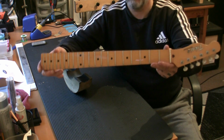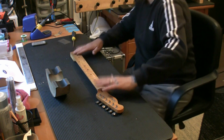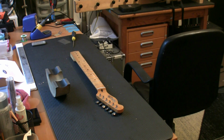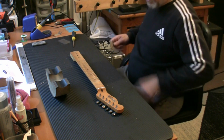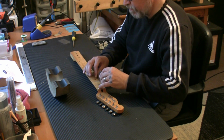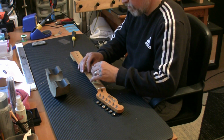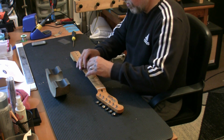There's no way I'm going to be able to recrown these frets if I do level some, but what I am going to do in the meantime is check for level. I do apologise if you can hear my tumble dryer in the background. I've left the workshop door open. We're going to grab the fret rocker. I'm just going to have a quick scoot over the fingerboard, over the fret, sorry. There's one high one already, and there. A little bit high, so we've got 2.